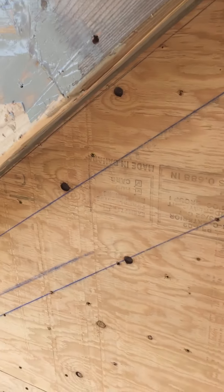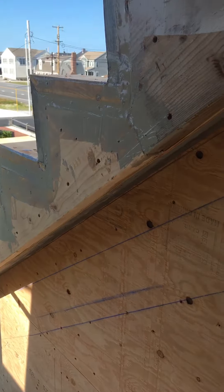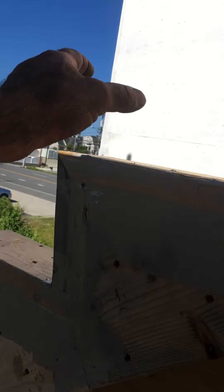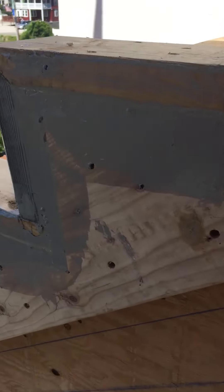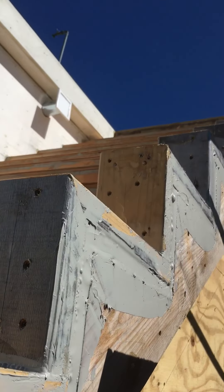A quick overview on how we're doing this: this is a built-out blocking for the handrail. When the handrail sets on these stair treads, there's good lagging here because we're gonna use something like a three-inch lag to lag down through all the handrail stanchions to keep it safe.